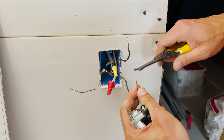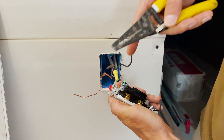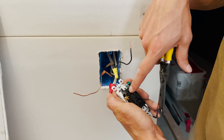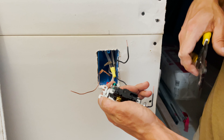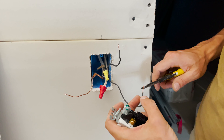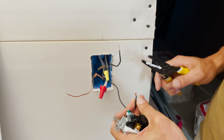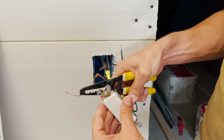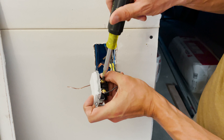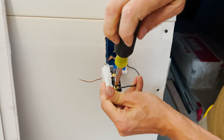We do have these little holes here where you can shove the wire in and it won't pull back out unless you insert a small tool to release it. However, from my experience and that of electricians I've talked to, those push-in connectors have a tendency to fail. So it's recommended that you use the screw terminals instead. It's a little bit of a pain at first, but it took me a while to do it consistently without fighting it.